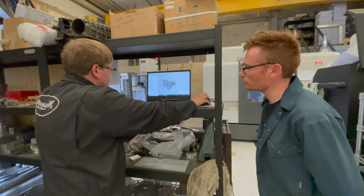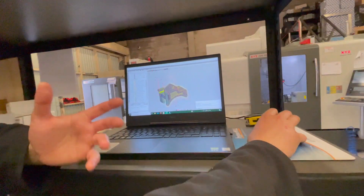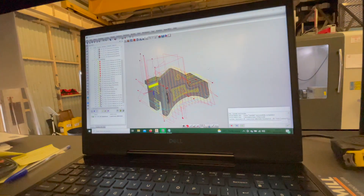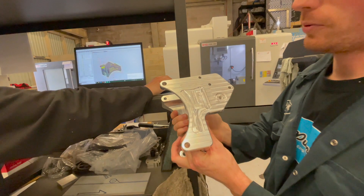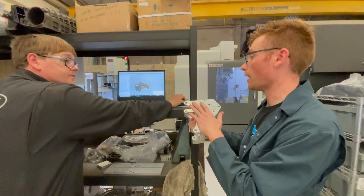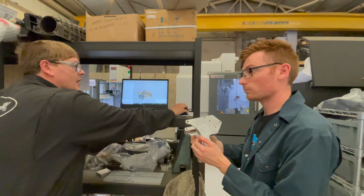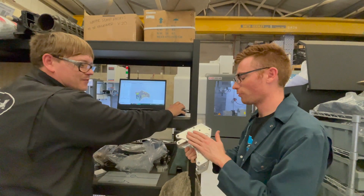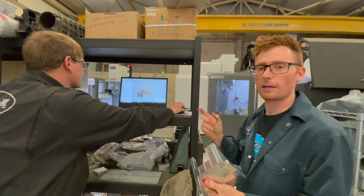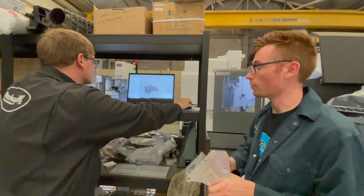We then go into finishing. The finishing cycles have a lot less lines on there. It's a lot slower because we're running at nice slow feed rates, which is what gets us these nice patterns and the nice shine that we see — which is very important. So if we didn't do that and just went straight in with the high-speed roughing, it would look like a 1990s computer — pixelated and rough. You might be able to see that in the timelapse because you can actually see step by step how it's gone through that.